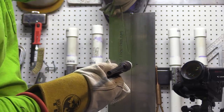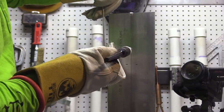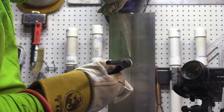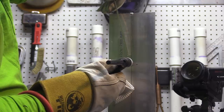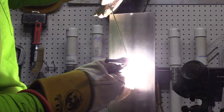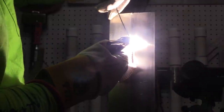Next is figuring out a place to get comfortable and a place to prop. This is a relatively small piece, and even though it's about 14 inches long, the heat's going to saturate it really quickly. So I've got my TIG finger on, and I'm going to use it not only as a heat shield but as a glide mechanism. It slides along pretty nicely on something like this.